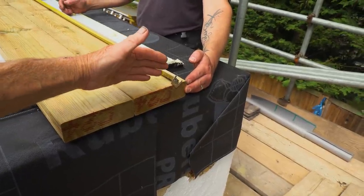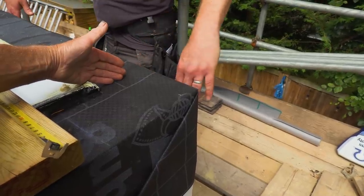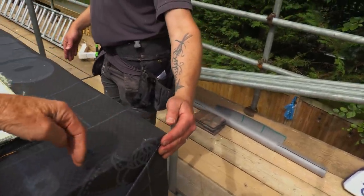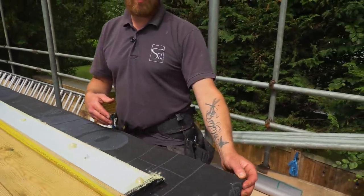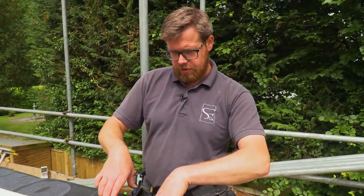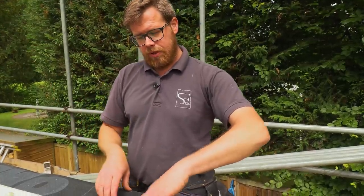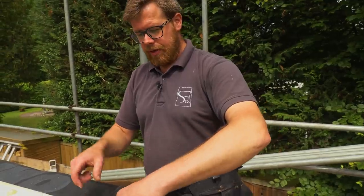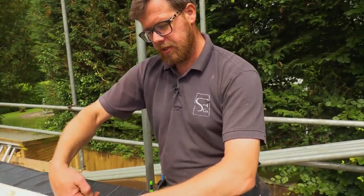That's the wall that's on the outside of the building — it goes right to this corner. What I do is I've got one stud there and one stud there at 150mm. Then when I build that wall, that's going to have another stud there. So they will nail together, but it means internally I've got a stud there and a stud there, so that will take that plasterboard.